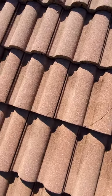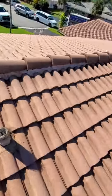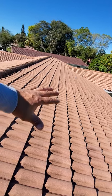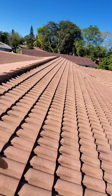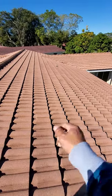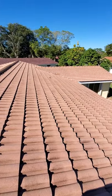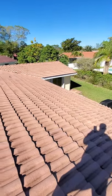They can't be blamed for it. These aren't big problems. Remember, water does blow up underneath these tile. The tile typically aren't the issue because tile roofs are a two-part system — underlayment underneath, and the tile is like UV protection and erosion protection against the underlayment. Wind can drive water up underneath these tile at times, and it definitely infiltrates in the valley areas, sometimes around these pipes. But they're built in such a way that water can drain out at the bottom of the roof. As these roofs age, that becomes more and more difficult to happen.